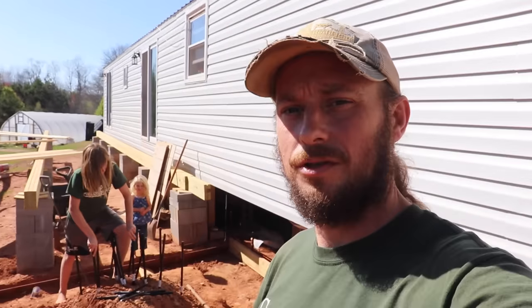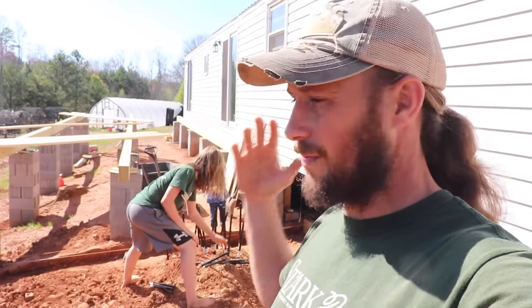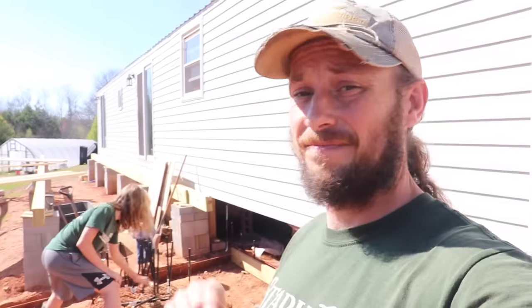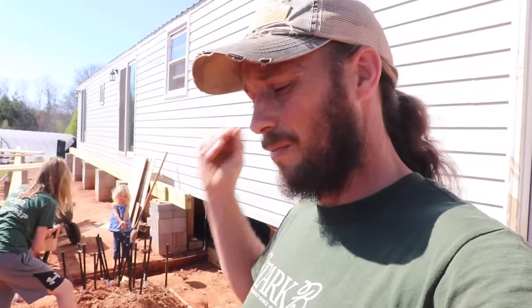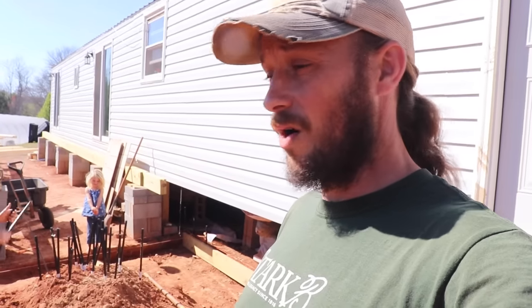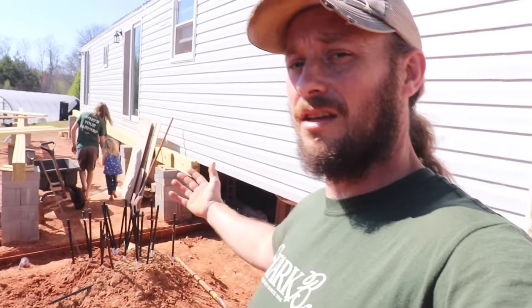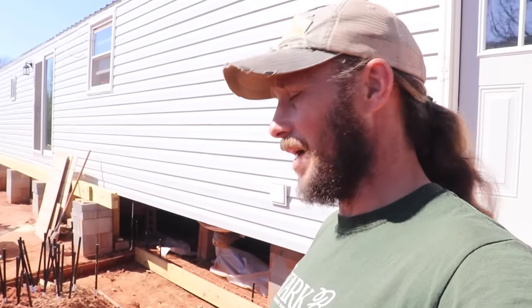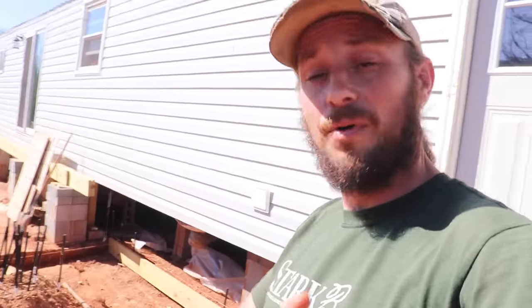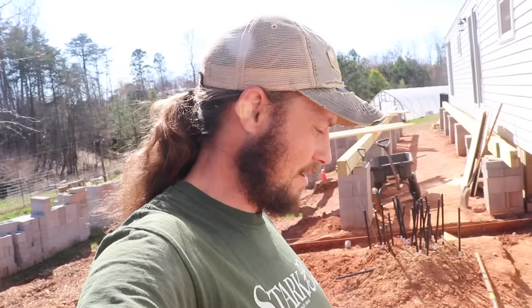I hate that I had to go buy some concrete stakes, but it's a necessary evil. I could sit with my table saw and cut stakes, but I've done concrete with metal stakes and with wood stakes and I detest wood stakes. You pound on them, they break. This ground is really hard clay and rocky. Metal stakes are nice. It's kind of a bummer because I won't need these for a very long time — I'll stick them somewhere when I'm done with them. Or maybe I'll sell them or something, but necessary evil. I got them, I'm good.